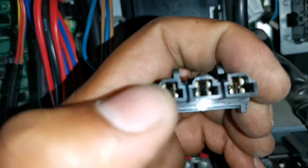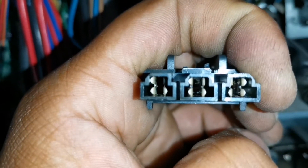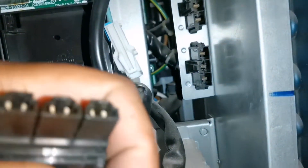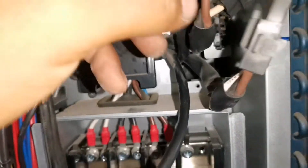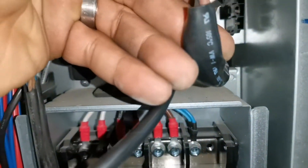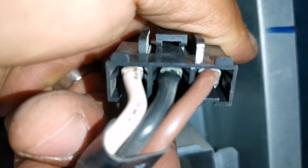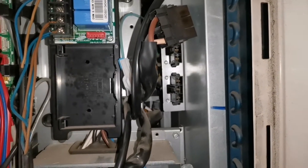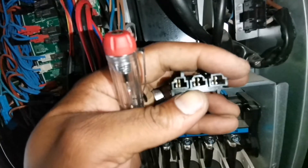The power is off - just in case you were wondering why I'm so close. We'll see if we can close down those contacts. I'm actually a little bit disappointed in these designs. I'll see if this is a part that can be ordered. I'm going to recommend both connectors be replaced because we can actually melt the cable, and that can actually cause an electrical fire, which is very dangerous.